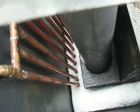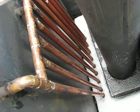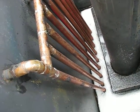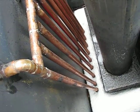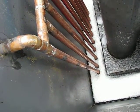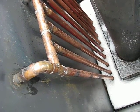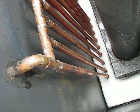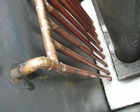You can see in the back here, I put some heat exchangers. This is for basically the hot water in my house for like showers and whatnot. Basically, this will replace my hot water heater in my house. It'll just be pumped through here, through these exchangers, and back into my water heater. Well, I'll still have my water heater, but I just won't have to have it turned on, so it won't be using electricity. It'll just be used as a hot water storage tank, which will be heated through this. I had to use these heat exchangers because the hot water in my house will all be pressurized, and the water in this tank will not be pressurized. So I had to have those heat exchangers.